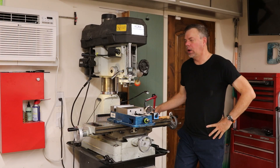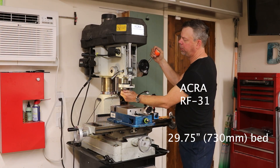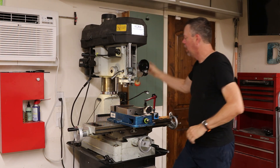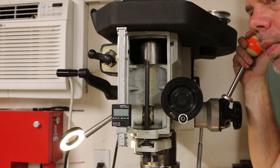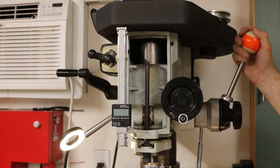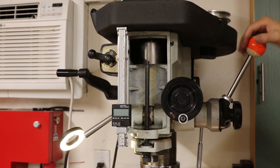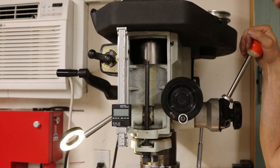This is a fairly intensive project for me. On my mill drill I want to replace the spindle bearings — actually the spindle and the drive sleeve bearings. This would require a complete tear down of the upper end, removing all the gearing. The spindle bearings are just generating too much heat; I think they're definitely on their way out. Measuring run out, it's about a thousandths of an inch — that shouldn't be an issue. But the heat issue is what's concerning me, that's what's driving this project.